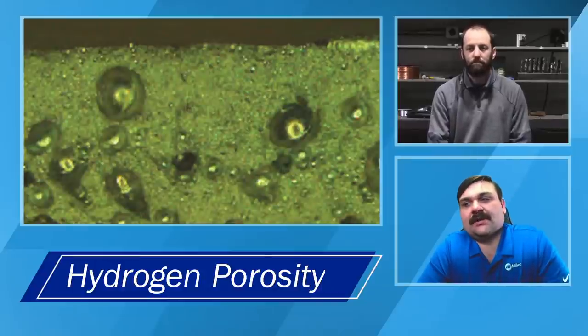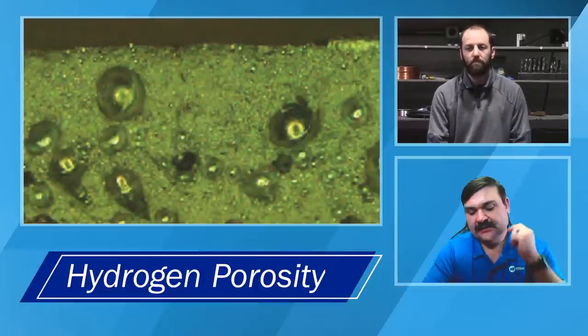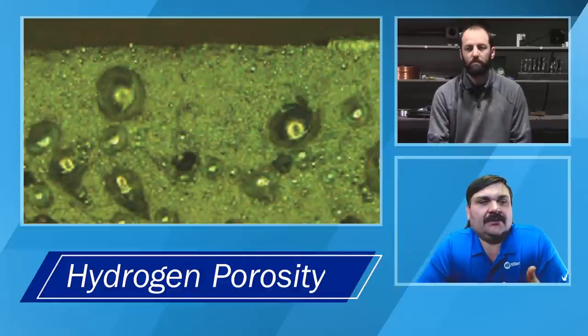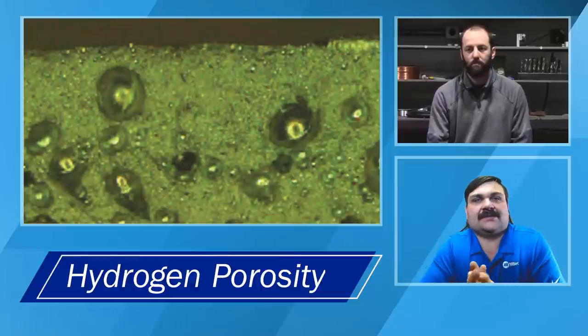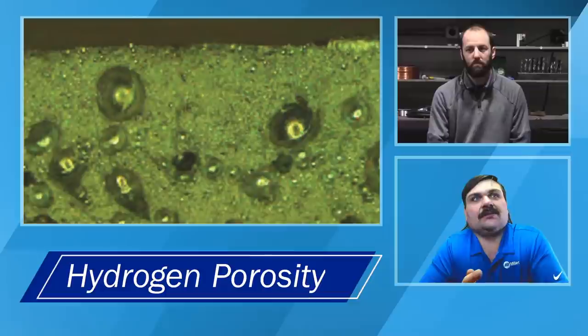Yeah, and a lot of these hydrocarbons can even come from surface prep, or oils and greases that are left on the surface. We'll talk about that in a little bit as well. But again, the general point here is that the oxide layer does a lot of good things for us. That oxide layer is really what drives a lot of aluminum's characteristics that we're looking for. It's very, very thin, but we need to get rid of it to weld.